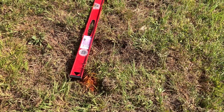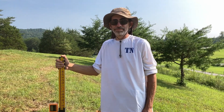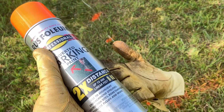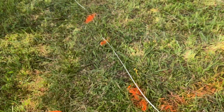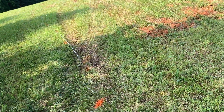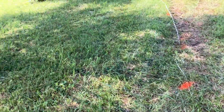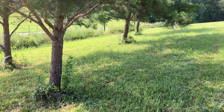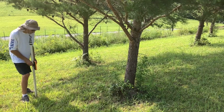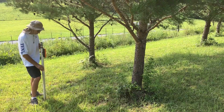A little orange spot for you. And this will be your guide for digging. Our first line is marked with this marking paint. And this first one is 84 feet, because we're hoping to get 20 chambers — 80 feet of chamber on this first row. And he is now setting up the second row.